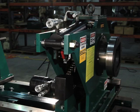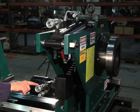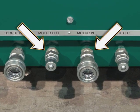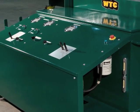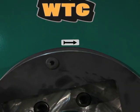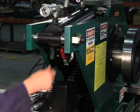There are two pairs of connections to the NTS 50. The lower connections are for the high speed nut runner, which rapidly turns piston nuts and end caps. These fittings connect to the two middle fittings on the mobile hydraulic cart. The nut runner is controlled by the nut runner joystick at the front of the mobile hydraulic cart. The nut runner can turn in either direction, but before turning opposite the direction shown by the arrows above the tool holders, make sure both of the NTS 50 cylinders are disengaged.